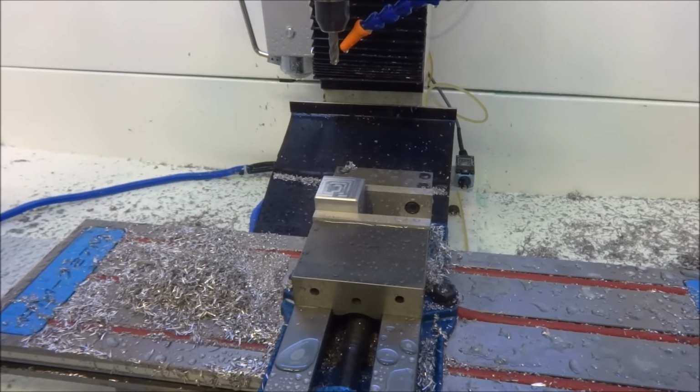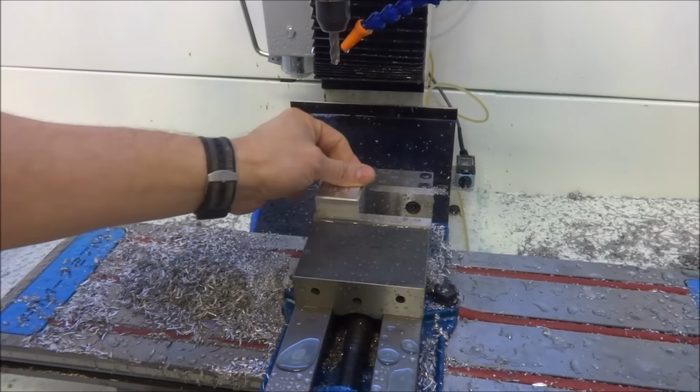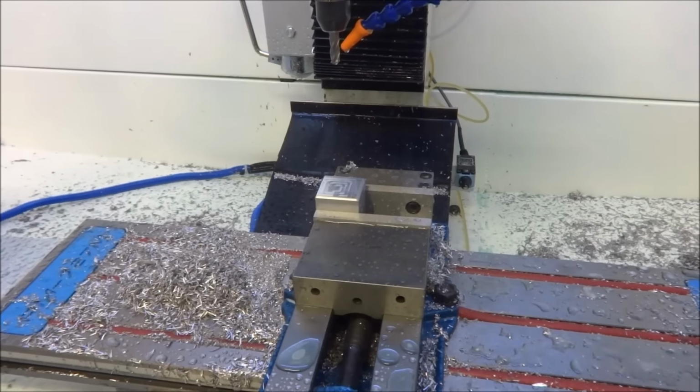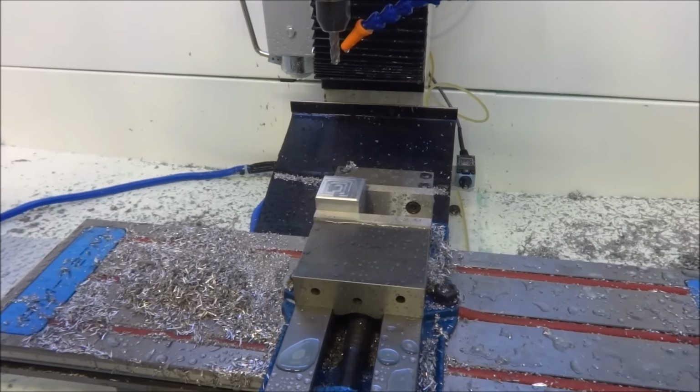And as you know, when we did the backlash test, I did have a little backlash in the X and the Y and the Z axis. Very, very little, if any, in the X and a little bit in the Y, but it's within a half a thousandth on the part. So I can't complain about that. I think that's pretty good tolerances there for a home-built CNC mill, not using precision ball screws. These are just RM2005. Pretty satisfied overall with the performance of the Precision Matthews. And now that I know my tolerances are good, I can start actually machining some accurate parts.